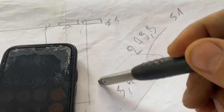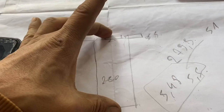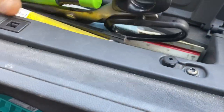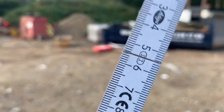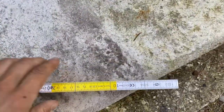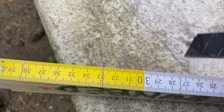That's only 0.2 millimetre difference - we're not gonna see that. So this is how I calculated my gauge of my brickwork. It's calculated with the height of this window because I can't change the height of the window - the windows are already in production. I already made myself a gauge stick. Normally I cut these gauges in my ruler with a metal saw blade, but now I just carved it in with a Stanley knife, putting my square against the metre and carving it in.